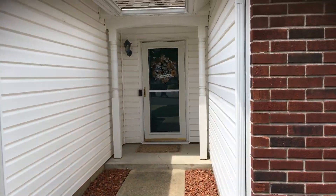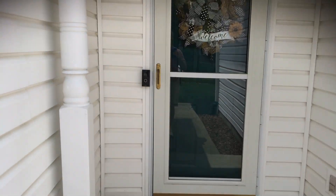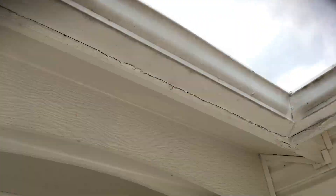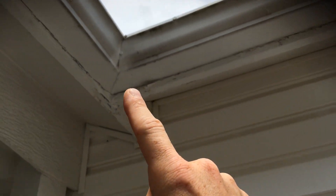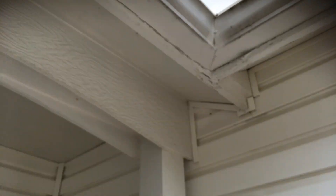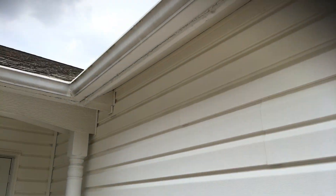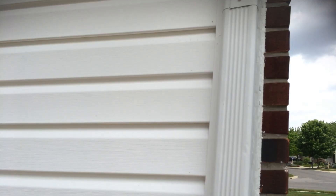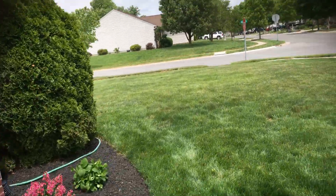No door, but the frame we would do, and this post as well. You've got areas like this where paint has been built up over time and we need to cut that away so that moisture can flow down, because moisture is catching where the gutter meets the gutter board and causing issues. We want to try to remedy that as best as possible — cutting that out and redoing the paint will help with that.